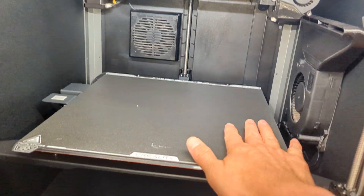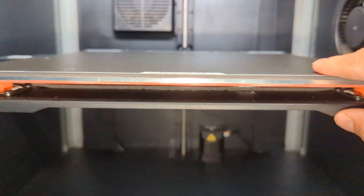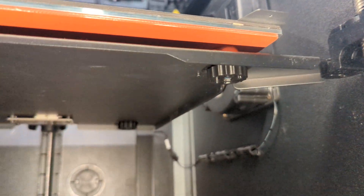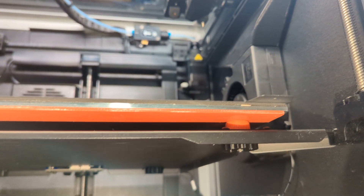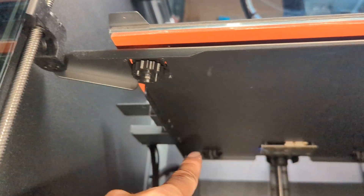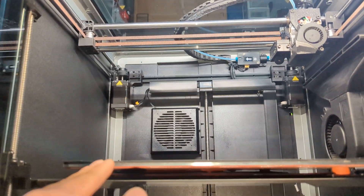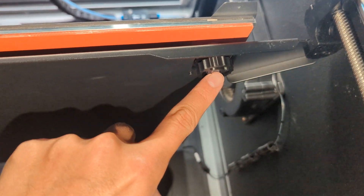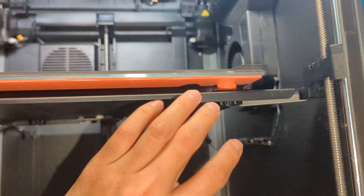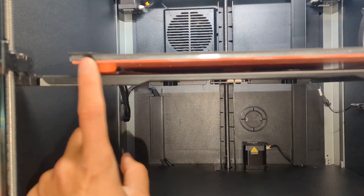Getting into the inside, I've upgraded my bed to a textured PEI bed, which is awesome. We also have silicone spacers for bed leveling, and these bed knobs made by Kirby — all found on Printables. They just require a little M4 nut and you can adjust the bed. If you have it rooted, you can run a screw leveling macro and get the bed perfectly level, which is really cool. These are 12mm silicone spacers — I bought the orange ones so they match the heater, which makes it look cleaner. If you use the correct size screws or cut them to size, they won't be sticking out and it looks really clean.